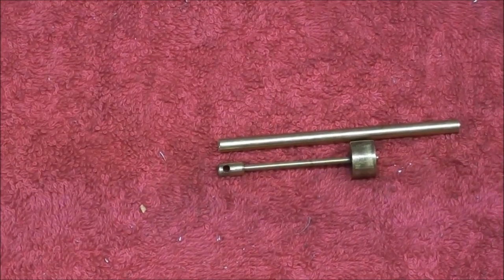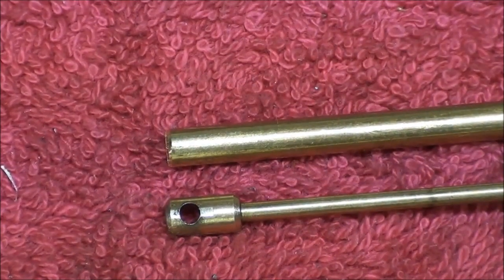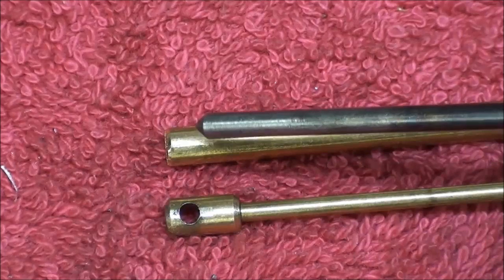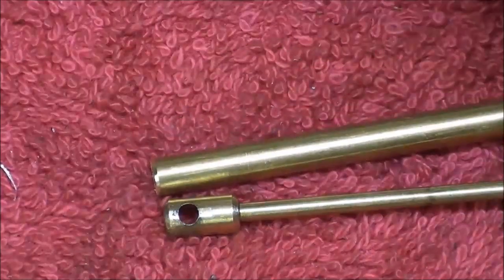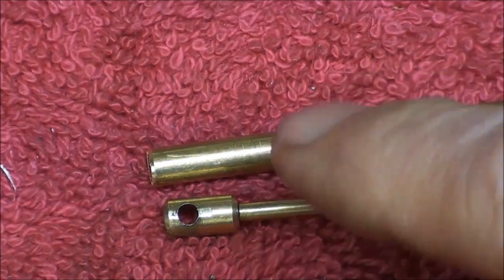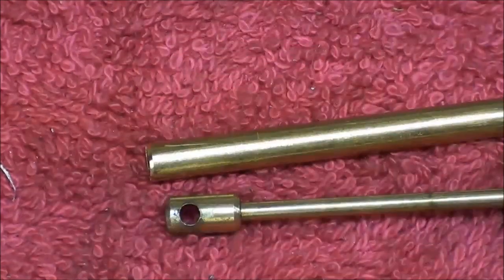I'm getting down to the end here. All the parts still needed are the piston, the piston rod, and this little connecting rod end — I'll start with that and make it out of brass. This is 3/16ths brass, and I need to drill an 1/8 inch cross hole in it. I'm going to do that on the milling machine so that the cross hole ends up centered. What I like to do is bring a cutter up just until it touches and get a little flat spot — that's going to be the center, without needing a wiggler or edge finder. Then center drill it and drill 1/8 inch through.